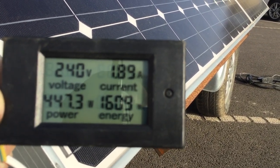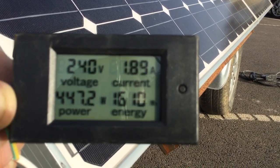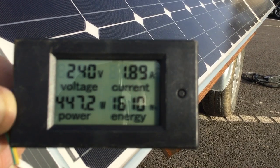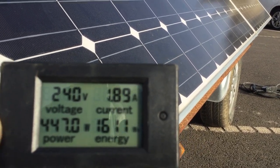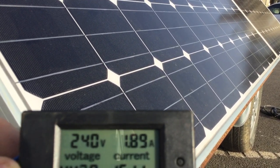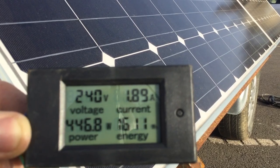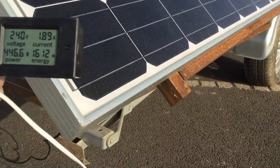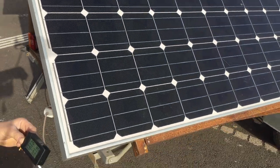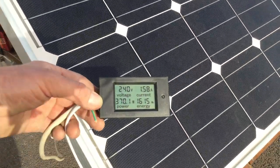It's not midday sun, it's more like 17:00, so we're producing, but normally we would have a power between 800 and 900 watts for 4 panels. As for panel maintenance, the best would be to coat them with ceramic — treated a bit like a car paint job — so that water doesn't hold on top. This micro-inverter is not very penalizing.